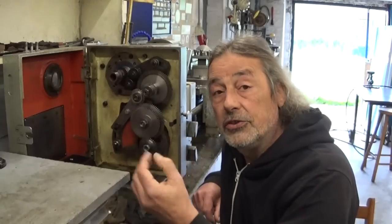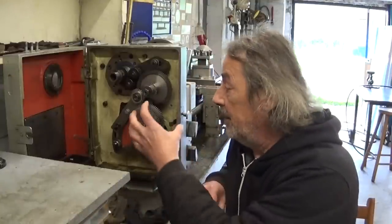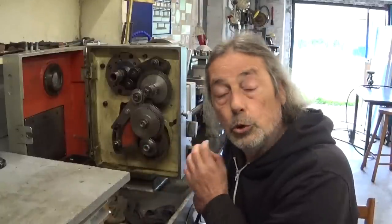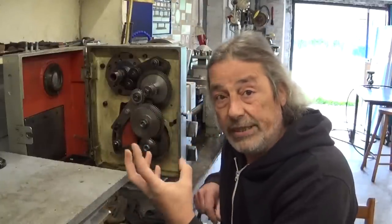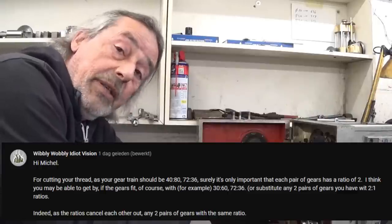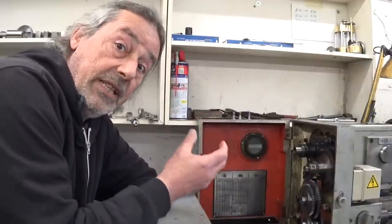The YouTube University strikes again. Because in a previous video I explained that I need an 80 teeth gear here for my gear train on the lathe to be able to cut a 2 mm pitch thread. And there was a comment from Wibbly Wobbly Idiot Vision telling me that maybe I don't need an 80 teeth gear.